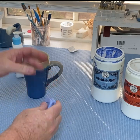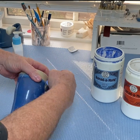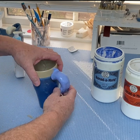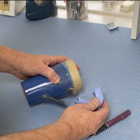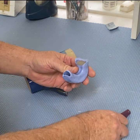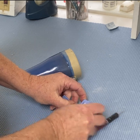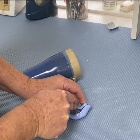This is fast-forwarded so I'm not doing it that fast. Apply the casting rubber gently — the clay is still a little soft, so be careful. Make sure you squeeze it everywhere so it takes a proper impression. Once it's cured a few hours later, you take it off. The trick is to take the clay out without damaging the mold.